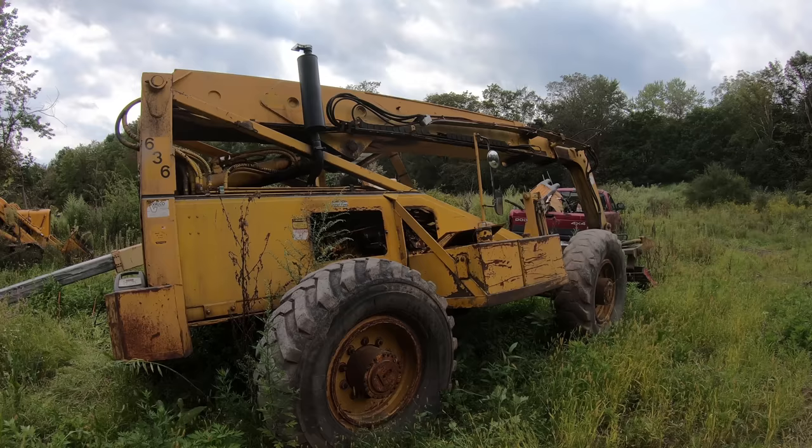So I just need to change over the different fittings on it, and I might have to get a hydraulic hose or two made because they might not be long enough or whatever. So this part here mounts on the cylinder, and then this gets mounted to it. So on this one, it has a bigger port, so we adapted it down to this size, which is half inch pipe. And then I can just put this right on there like that.